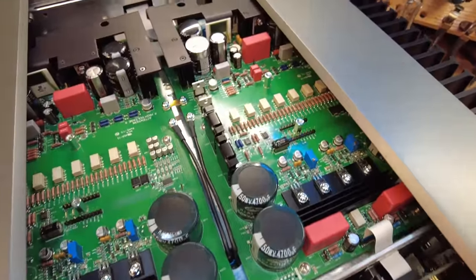I also see some cosmetic distress here. On this capacitor the shrink wrap has failed or shrank, and the tops have come off. It's a common cosmetic issue when some of these caps are mounted very close to the voltage regulators — the heat just essentially shrinks the wrapping around it. It doesn't mean it's going to fail, it's not a reliability issue, just something we like to see neat and tight throughout its lifespan.